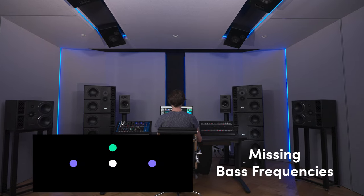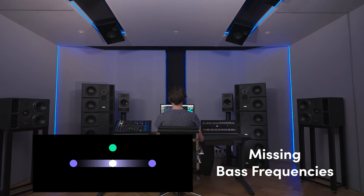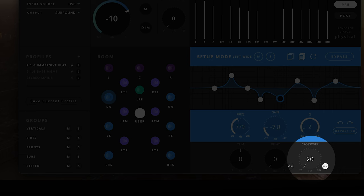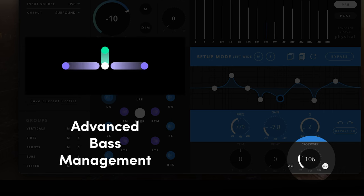Immersive audio setups include an LFE channel — low frequency effects — and this comes out of a dedicated subwoofer. In an ideal system, each speaker in the array would be able to produce low frequencies as well, this being especially important in immersive music mixing, where instruments would likely extend down into bass frequencies, such as a kick drum or a bass guitar. In practice, many speakers in immersive setups may not be able to recreate those sub frequencies, especially height speakers, which are often smaller to accommodate positioning and ceiling mounting. To produce the lower frequencies of these channels, Aurea has a bass management system integrated.